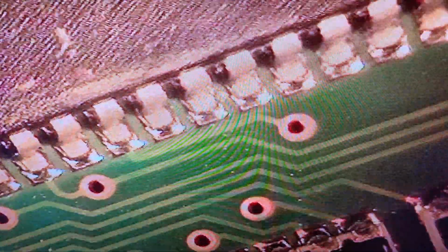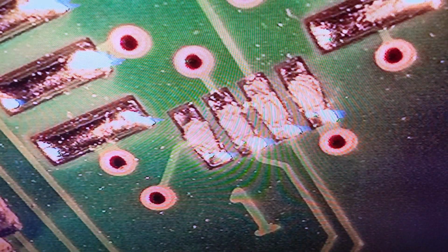Let's take a look at the pad where that came from, right here. So if we take a look, I think it was these 4 pins on the bottom and 4 pins on the top. And if you look at these solder pads, let's see if we can zoom in. You can probably see it there, but let's zoom in. You can see, there we go, focus there, that the IC was once attached to these solder pads right here, but it is not any longer. So I say let's attempt to put it back on.